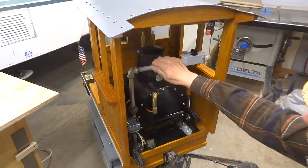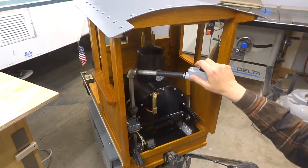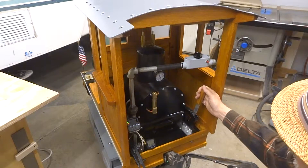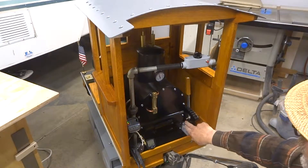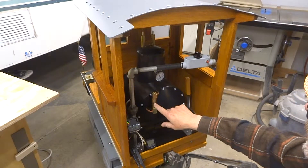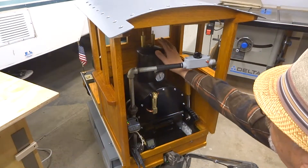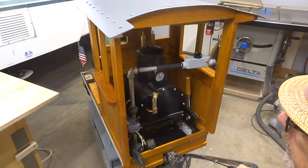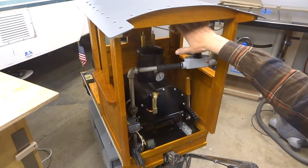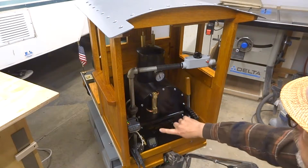Here's the inside of the cab. This is the control bar here — I've got speed, an auxiliary horn, and a light switch. This will move into position to whatever's comfortable. Here's the Johnson bar for forward and reverse. Got a toggle switch hooked up here that basically tells the speed controller what to do. Our little water glass, our sight glass here. Steam pressure, so to speak — remember this isn't a real steam engine. Here's our steam dome, two safeties up here, and a system that provides air pressure for the horn. This is the pull to engage the horn. Voltmeter, speedometer, and firebox in here.